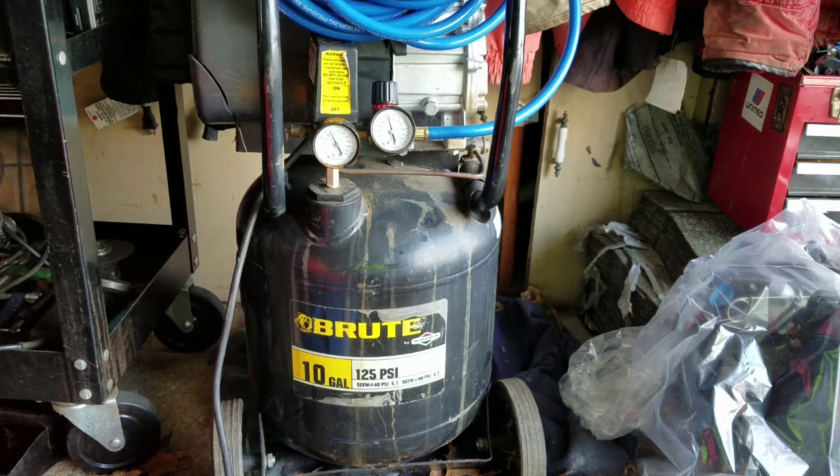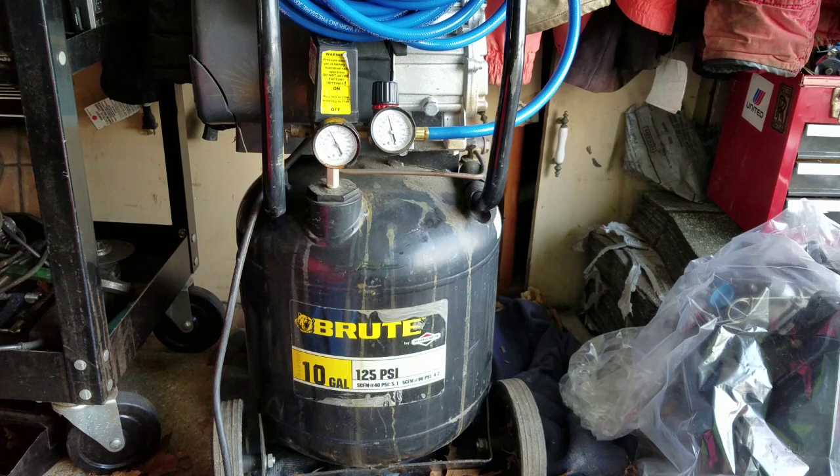This was a long video, but it's only two parts — not three. Thanks for joining me on my repair of this Brute 10-gallon 125 PSI air compressor. It just needed a reed valve, gaskets, and an oil change, and it works well from what I can see so far. I'm not an expert in this field, but if I can power these three tools, it's fantastic. Years ago I tried powering air tools with a $99 small cylindrical compressor and it wouldn't even turn anything on. This is definitely working. The tools are working, and I question whether the impact will be stronger than my electric impact, but we'll see. See you guys next time on Mowers and Blowers.